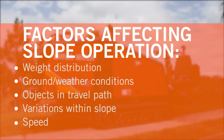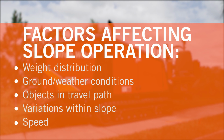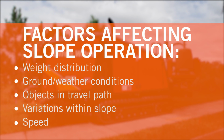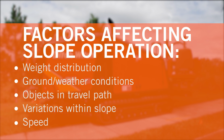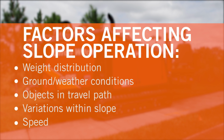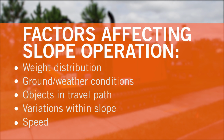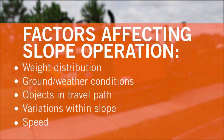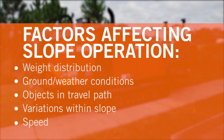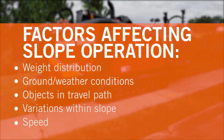Ground conditions, such as loose or wet soil, rough terrain, etc., reduce traction. Never work on an incline during rain, snow, or sleet. Saturated soil can give way and cause the machine to become unstable and tip over. Always travel slowly, with the heaviest side of the machine uphill. If a rollover was to occur, the operator needs to stay on the uphill side to avoid becoming pinned under the machine. The heavy side of the machine may change depending on whether the pipe box is empty or full.